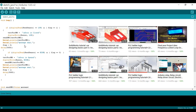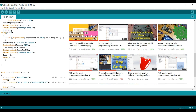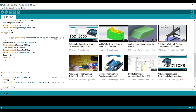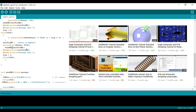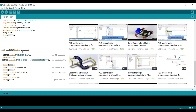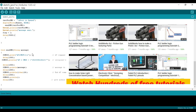The second condition: if digitalRead(reedSensor) is HIGH and flag equals 0, the door is open — we set textForSMS to 'Door is opened', turn on the buzzer, send the SMS, print to the serial monitor for debugging, set flag to 1, and delay 5 seconds. The void sendSMS() is a user-defined function used to send a message to a particular number — just replace the number with yours. This function was also used in previous tutorials.